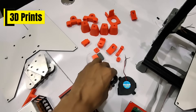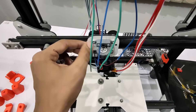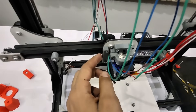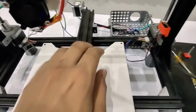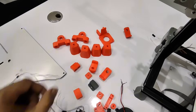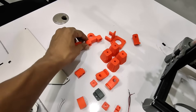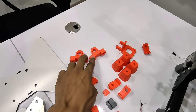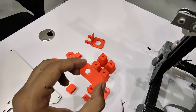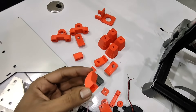Now for the 3D printed parts: these prints are for the X-axis gantry to hold the hotend, and this print is used to trigger the end stop. On the Y-axis the end stop is placed here, and on the Z-axis the end stop is placed here. These four prints are the feet or base of the 3D printer. These two are Z-axis brass nut holders so the screw can move up and down. This is the Z-axis motor mount and this is the holder for the screw rod.